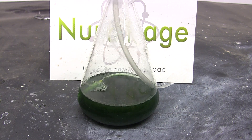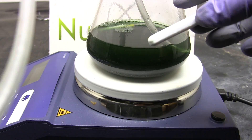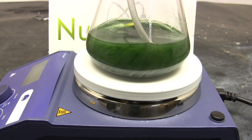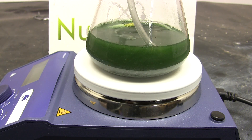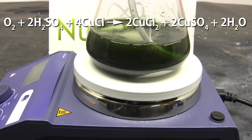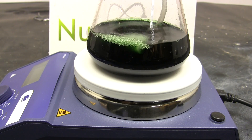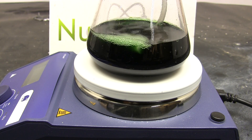This can take a very long time — up to a few days. Since I'm rather impatient, I'm going to speed things up by stirring the solution on my hot plate stirrer as well as heating the solution to 60 degrees Celsius. This should be done in a few hours. What's happening is that we're oxidizing the insoluble copper(I) chloride into soluble copper ions. Here we are about three hours later with everything dissolved.